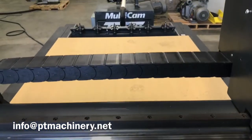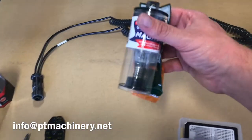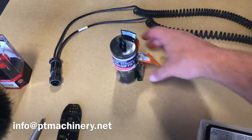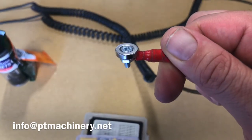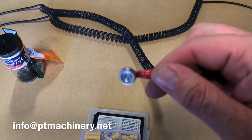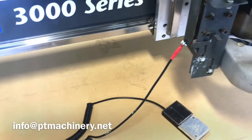We're going to go through all of that in detail, so if you like that kind of content I'll provide a link in the description below. Lastly, a look at the grounding magnet — we make this up with a screw, a washer, a nut, and rare earth magnets, put that into a wire, and use it as our grounding magnet. We stick it to the tool holder and set our surface or calibrate our tools using that — and that's what the factory does now instead of a plastic grounding collar. Thanks for watching; for more information please contact ProTech Machinery.